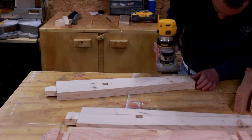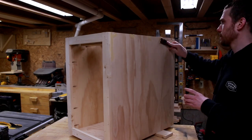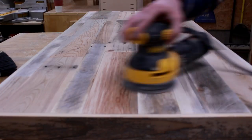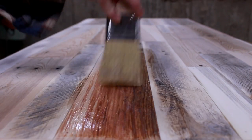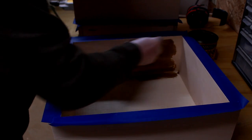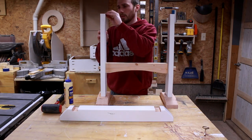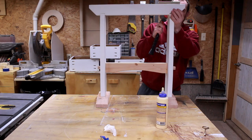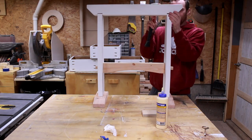I filled all my screw holes, nail holes, and any other imperfections with wood filler, then sanded everything starting with 80 grit and moving up to 220 grit sandpaper. For the desktop and drawer front finish I used a water-based polyacrylic from Minwax — I really wanted to keep all the original colors from the wood and this finish was pretty true to color. I stained the inside of the drawers with early American stain and for contrast painted everything else white. I then assembled the sawhorse, removed the painter's tape from glue contact areas, and added wood glue at all the joints for extra strength. Off camera I painted the feet white and went over everything with a clear coat of polyacrylic as well.